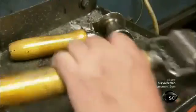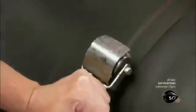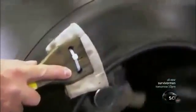He uses a roller to press out any trapped air between the plies and belts. This helps ensure a thorough bond. After a stitcher wheel folds down the plies, he folds the ends of the material into the machine. Then he applies a contact cement type material to enhance the natural adhesion of uncured rubber.